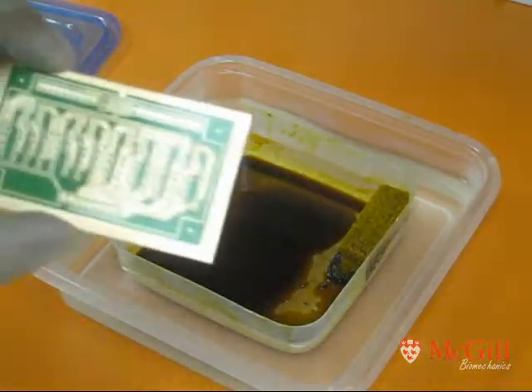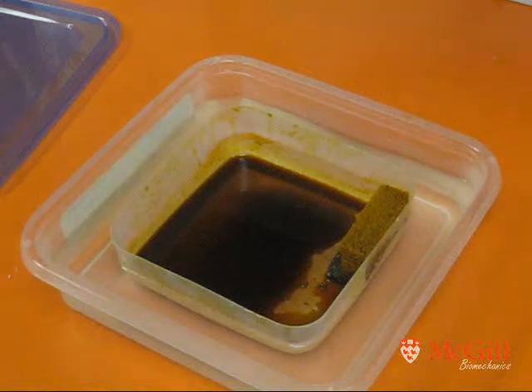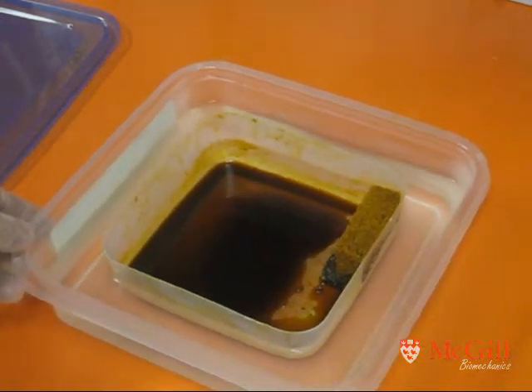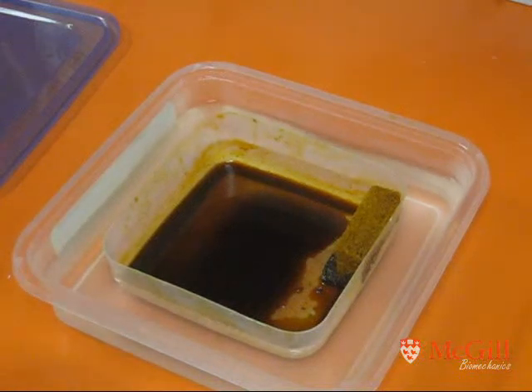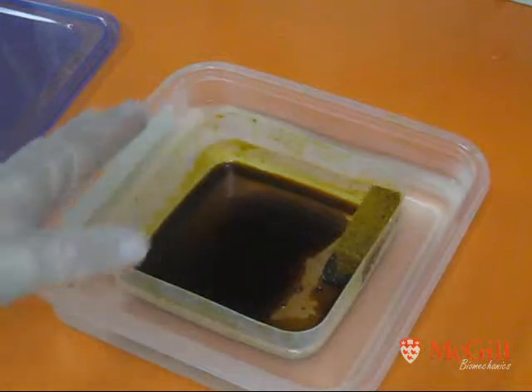Do an inspection and continue to go over any little spots where a hole might exist or a track has been covered. Once our green has been inspected and cleaned off thoroughly, we're ready to etch. I'm using a contact etch technique from the PCB fab site. Basically what I've created here is a little double pool.